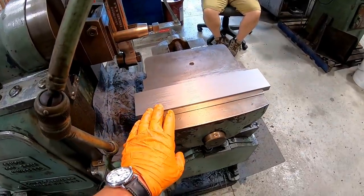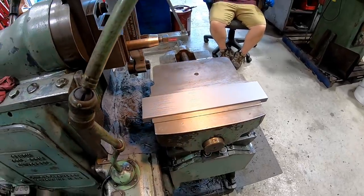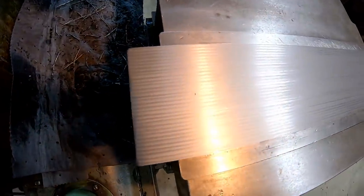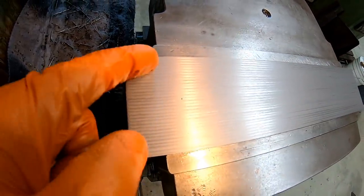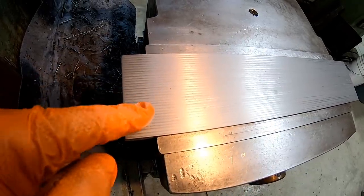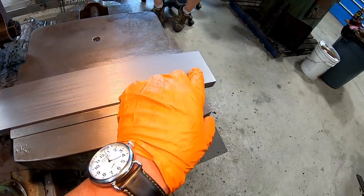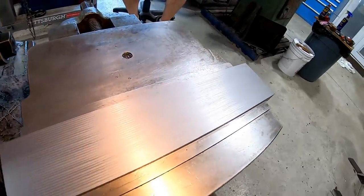This is that steel flat bar that we've been just kind of experimenting with on getting it cut flat with the square nose tool like we were doing with cast iron. And I'm gonna try to get you in so you can see that finish. You see these parallel lines? So right in here, we measured it with 2/10 variation between the cuts. It gets a little bit worse on out here the further out you go, but it's still beautiful.